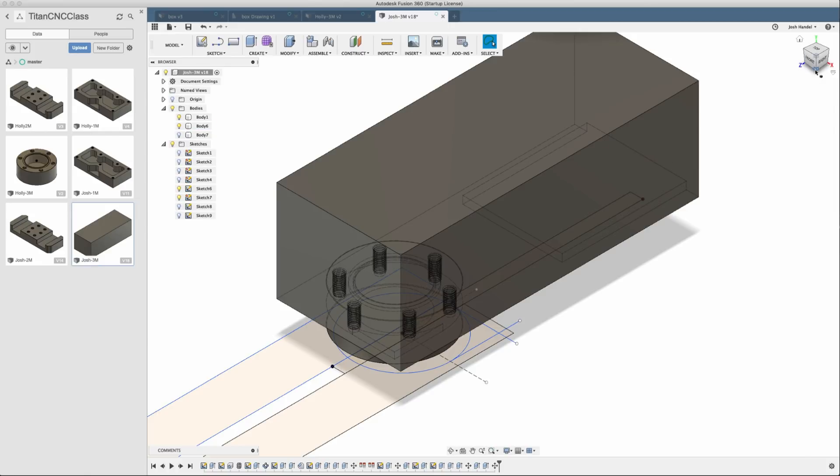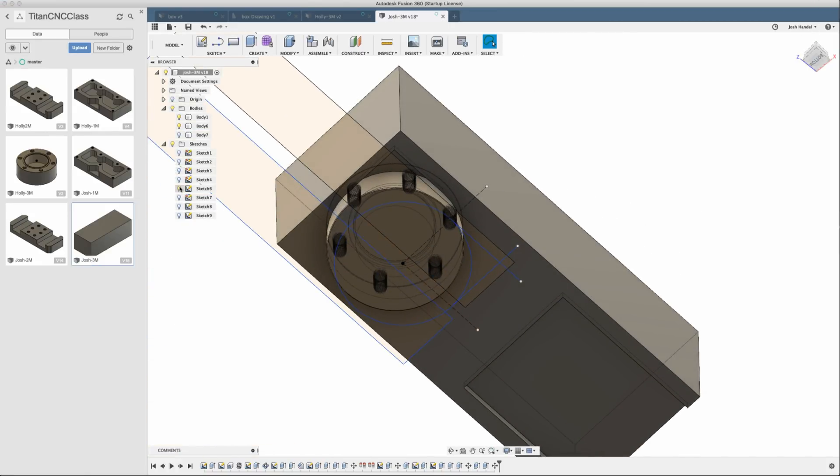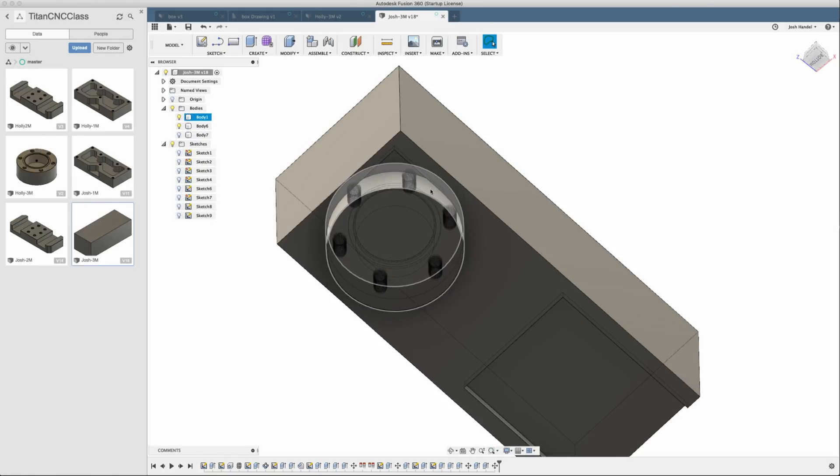The one thing I did with my soft jaws is — if you notice here is this corner — I'm going to find this corner, specifically the bottom of this platform and then this edge and this edge, rather than trying to find the center of a round object. And then I know where my part is versus that. I just wanted to show that real quick.